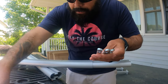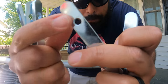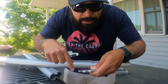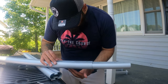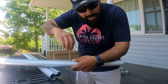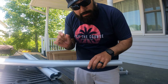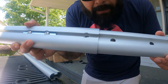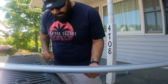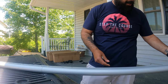To put them together you need these little plates that go right in the tracks — three on the top and three on the bottom. The difference is that the top plates are not threaded while the bottom plates are threaded, essentially acting as the nut since there's no separate nut. Getting the first one in is probably the hardest part; after that the second one lines up fine. Just make sure you don't tighten the screws all the way down until all pieces and screws are in, because there's a little wiggle room and you want everything to line up perfectly.